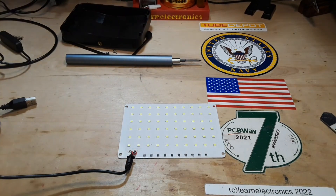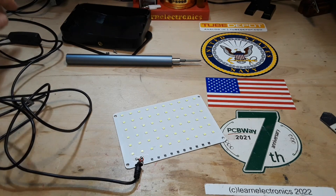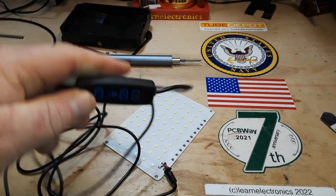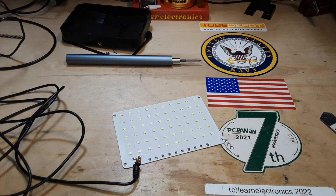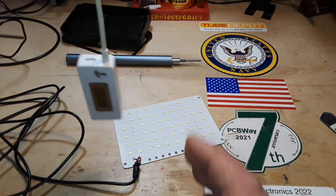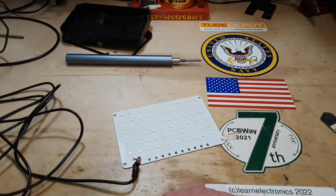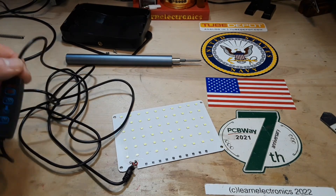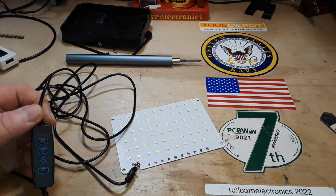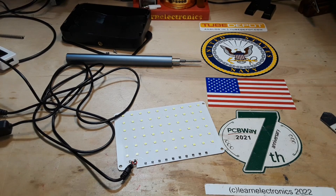So this is the USB board, and it has a little adjustable power dial. I figured we can plug it into a USB power bank, run the USB doctor on it to see what kind of power it's pulling. We'll also put a meter across the contacts to see what's going on. I doubt this is actually changing the voltage — maybe it's PWM-ing it. We're going to find out.